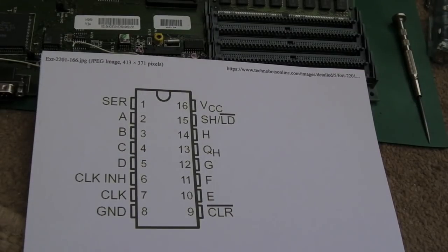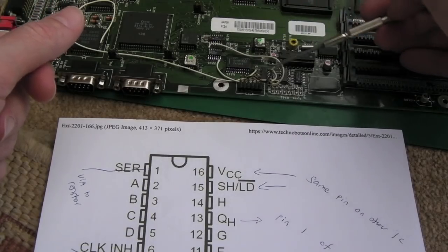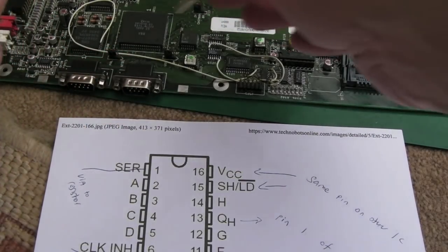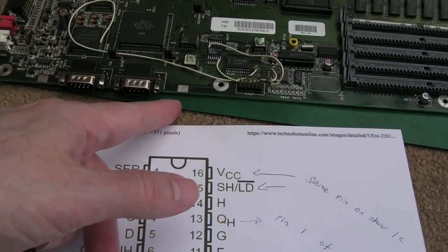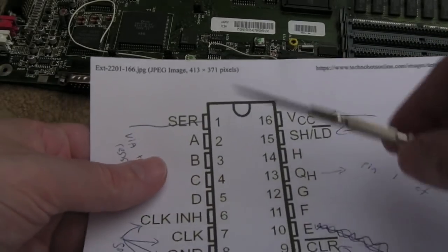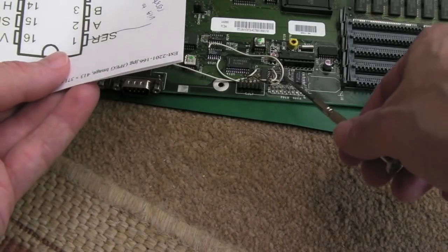So I've got the pin out of the chip here, just because that's going to help me work out what needs to go where on the one we've just stuck down. Making sense of the connections here, it looks like the VCC and ground are missing off this IC actually, and then we've also got a wire going up here, a crazy long one, you can just about see, to Paula. It's just because of a broken trace, so I can fix that without a wire that long, I'm sure. And then the other one down here is just another fix because there's a broken trace. So anyway, if I exclude all that lot, I've got the pin out here of the IC that we're going to put, and it's going to be that way around on the board, our chip here.